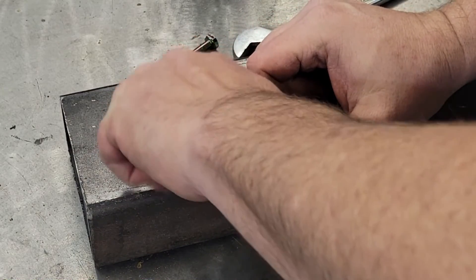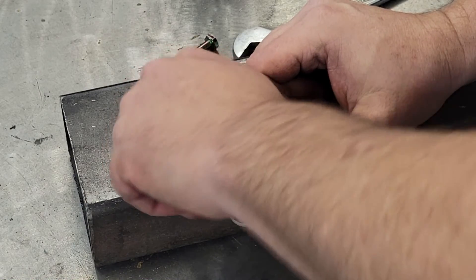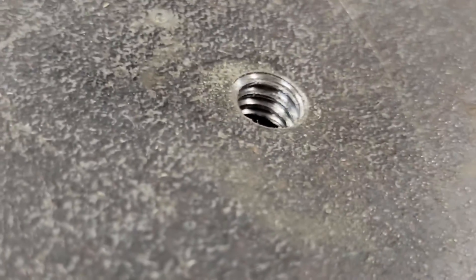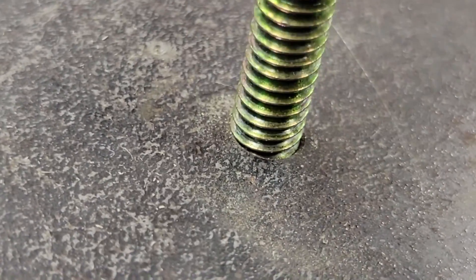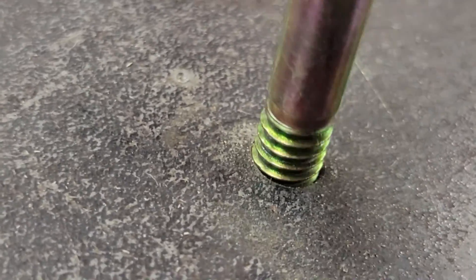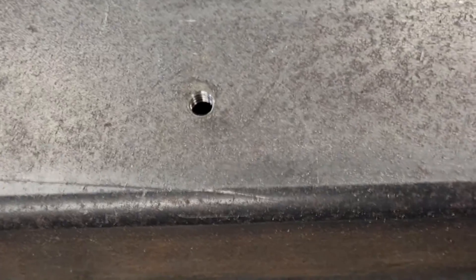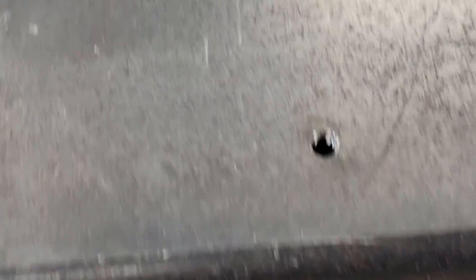Okay guys, that's it. I hope this helps you. Like I said, I wouldn't go any less than 3 millimeters or about an eighth inch wall thickness to give enough threads. Check out those clean threads right there — that thing's nice. Run her down by hand, she seats down real good. Now doesn't that look so much better than one of those riv-nuts, and we don't have to worry about that coming out. Hope you all enjoyed that quick little video on how to drill and tap anywhere you want to — you might need to put a bracket, motor mount, whatever you need to do. Now you guys have the power to do it. Super easy. Links to all the stuff are in the description below.